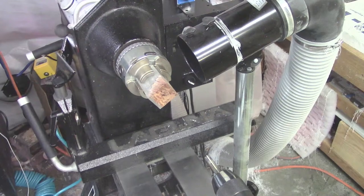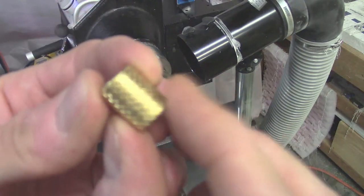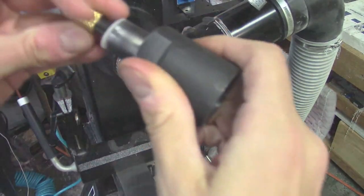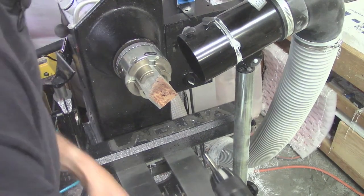The other alternative way that you can go for these things, if you're doing stoppers or handles or anything that takes the 3/8-16 threads that will fit on the universal mandrel, which is quite a few, like bottle openers, a lot of the ice cream scoops, all that kind of stuff. The alternative way is you just drill a 1/2-inch hole and then glue in one of these brass inserts, and then it'll fit on the mandrel at that point. Problem I have with that is then you've got to wait for the glue to dry and all that. And it's not entirely necessary, I don't think.